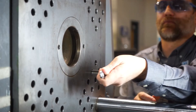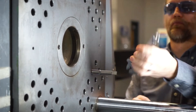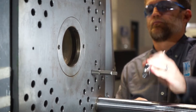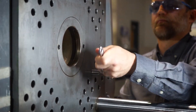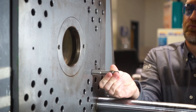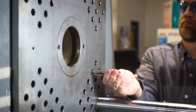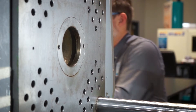It's amazing how much easier it is to tighten those bolts during a mold change after doing this. If you have to struggle to thread your bolt in with a torque wrench, something is wrong with either the bolt threads or the hole threads. Doing this occasionally keeps everything in great shape. If the tap goes in that easily, you know the bolt will too. When I back it out, it should come out just as easily — if it doesn't, something's wrong.